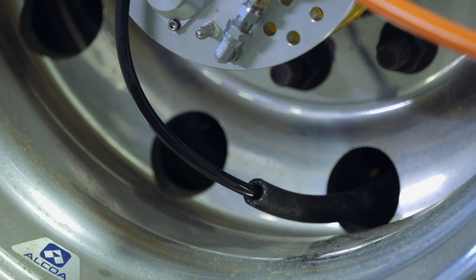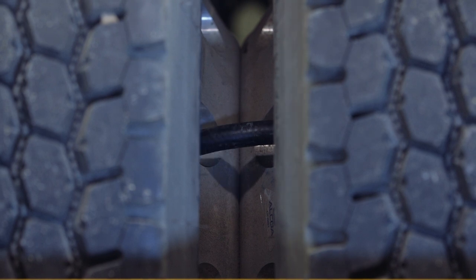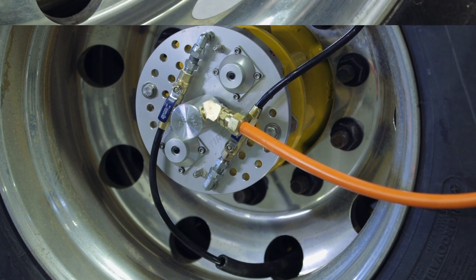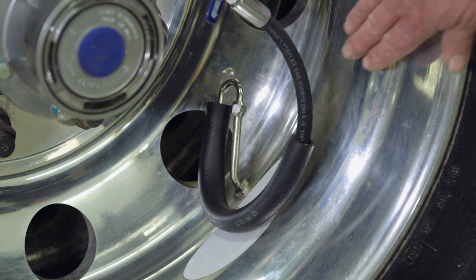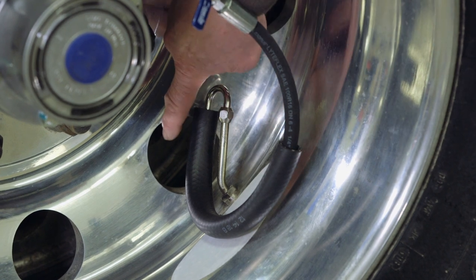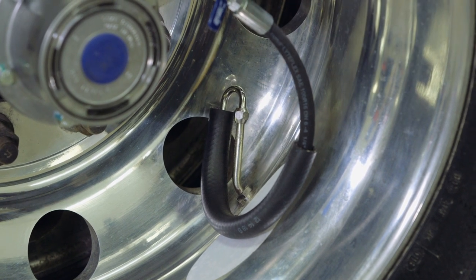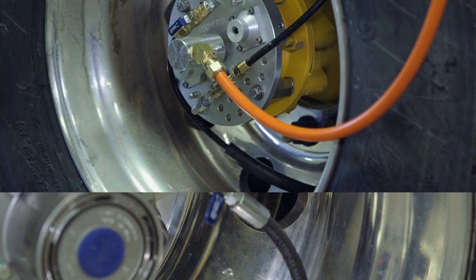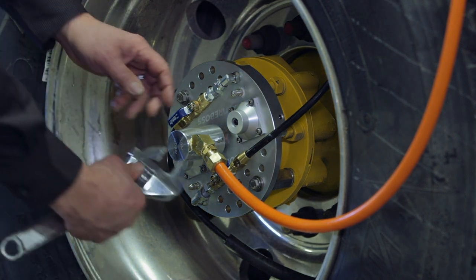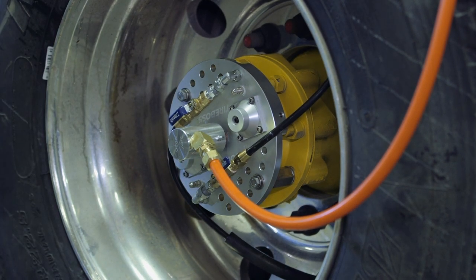In off-road applications, it is important that the inner wheel hose connection to the valve stem is covered by the protective sleeve slid right to the base of the valve stem. This is often missed on tire servicing and leaves the valve stem at risk of breakage when off-road. When wheel hoses are attached to the valve stems on the outer wheel, position the valve stem so it is not protruding between the duals — turn it to the inside so none of the hardware sticks down between the dual wheels, protecting the hose and fittings. For those who use tire chains, simply turn the fitting at the drop lines out slightly to provide more clearance to the tire.